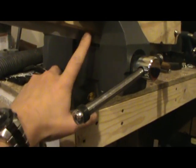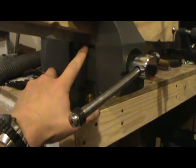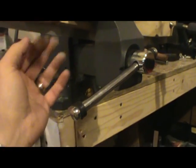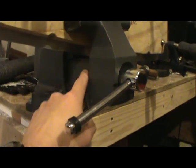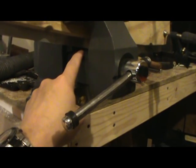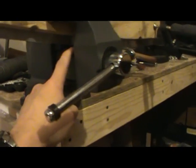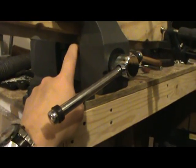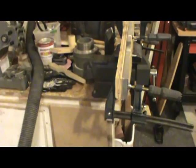I didn't even know it was happening because it was happening gradually. So make sure when you're clamped in the vice that you've got the flange material clamped tightly and you've got at least some gap so that you're not resting the metal against the vice arm. You don't even want to do it after it's formed either — you definitely don't want the flange resting against that part.